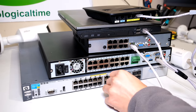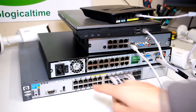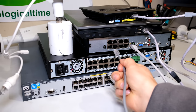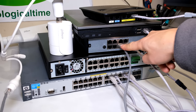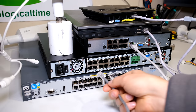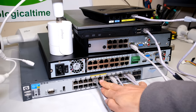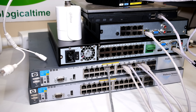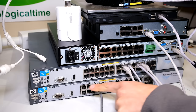You can also connect another NVR to the same switch. Both NVRs can access cameras plugged into the PoE switch, and this NVR can access the internet because it's connected to the router. If a camera is plugged into a specific NVR, only that NVR can access it. If you want both NVRs to access the same camera, plug it into the communal switch. In summary, you can use the PoE ports on the back of your NVR, connect cameras to a PoE switch, and if you run out of capacity you can daisy-chain switches — just make sure you connect the switches to each other.